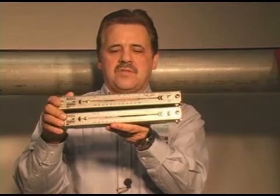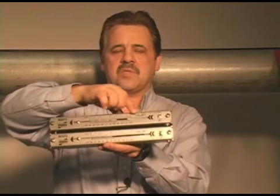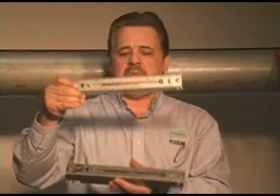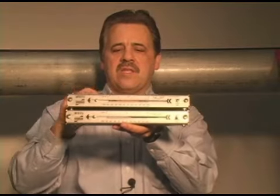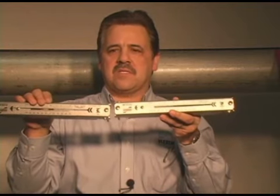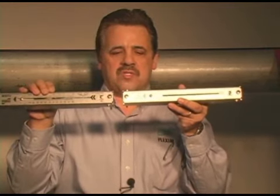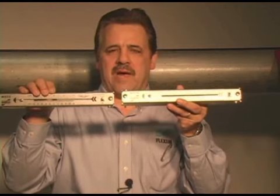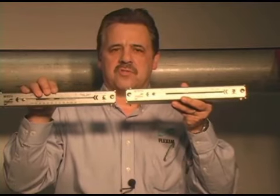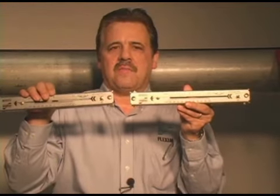Now, this M size track mount system here, the increments go from -2 inch to +2 inch. So the maximum distance I could space for a one-track rail mount would be 4 inches. If I have a spacing distance that's greater than 4 inches, I would have to put the two tracks side by side on the pipe and space the distance out accordingly. In this type of scenario, where the transducers are on the same side of the pipe, we call that two sound paths, where the sound beam travels out and echoes off the far pipe wall and back to the return transducer.